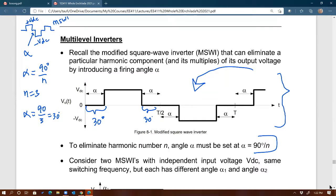So the problem with PWM is that you can run into significant switching loss, especially when the application calls for very high voltage, right? That's why for high voltage applications, people don't like to use PWM because there's a lot of switching, right? Imagine if you have to turn the switch on and off from 0 volts to, let's say, 12,000. Imagine the loss, right? That's why you should just do low voltage and then use a transformer after the inverter. Then you run into a loss from the transformer, right? Which is not good. That's actually going to be worse, right?